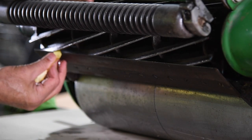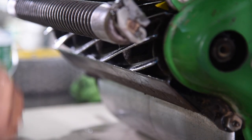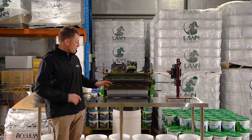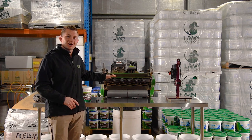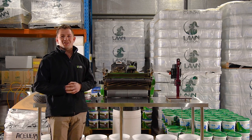Once you have completed this process, spray your cylinder, bed knife and other moving parts with WD-40 to stop corrosion and rust. So now you should have both your bed knife and your cylinder sharp, ready to give your lawn the perfect cut. Thanks for watching — don't forget to like and subscribe and we hope to catch you next time.